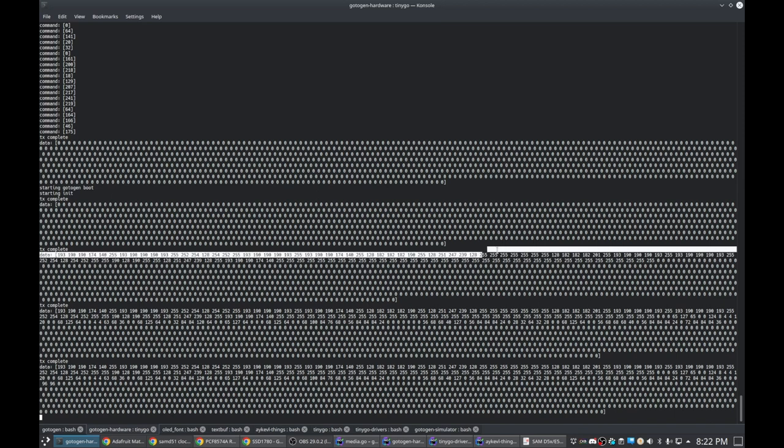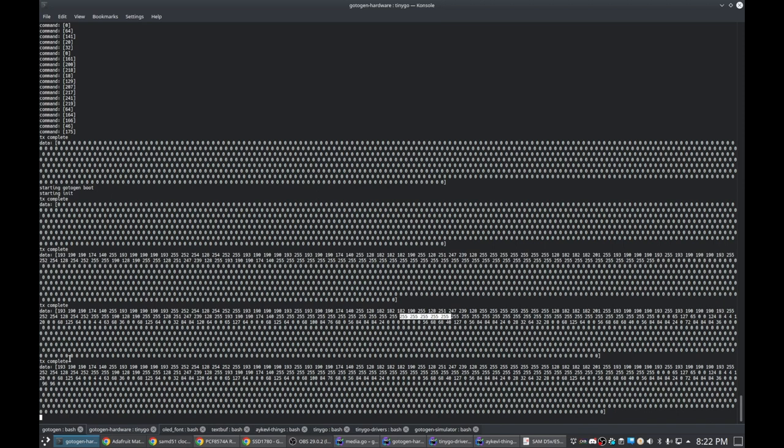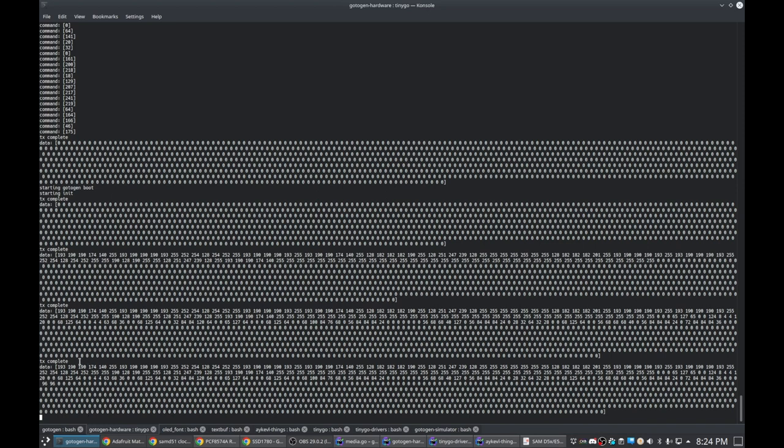You can quite clearly tell where the inverse video is here. This is just the inverse video here at the top with the solid lines of pixels. So we got three frames of data, but we never got a TX complete after the last one, which is why it's stuck. It is stuck waiting to be able to draw the next line of text. And because it never got the TX complete interrupt, that will not ever unstick. So why is it stuck? We see the data printed here that we have already flagged the transmission is starting, and then we say this is what we're sending, and then we start sending it. So we see that, but we never see a TX complete. So why are we never getting a TX complete?